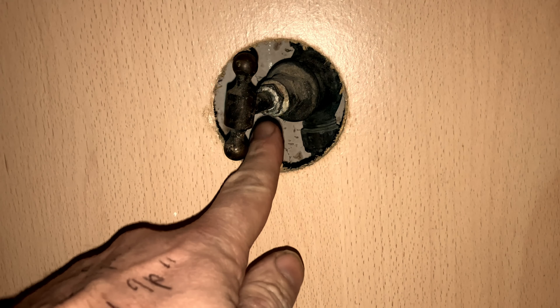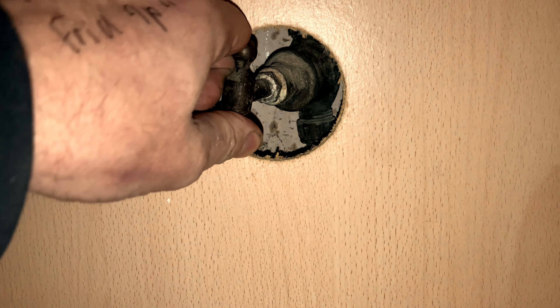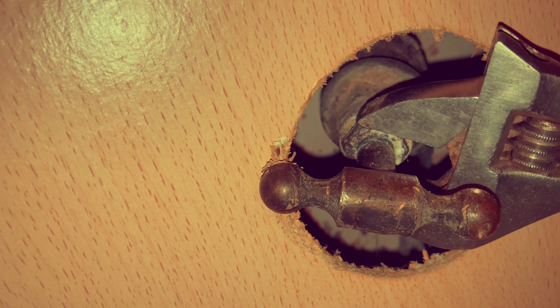Place padding in the bottom of the bath and always put the plug in. Next, isolate the water, which is usually under the sink. Always keep an eye on the packing gland when you turn the water on and off — this top tap is quite loose and there's a micro leak on the packing gland, so I'm giving it a tighten up.